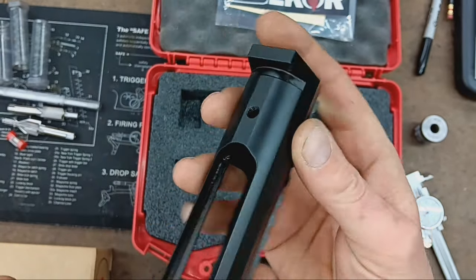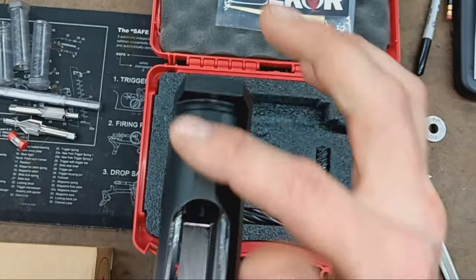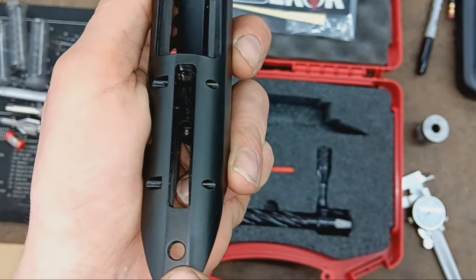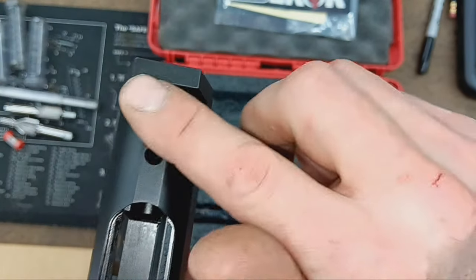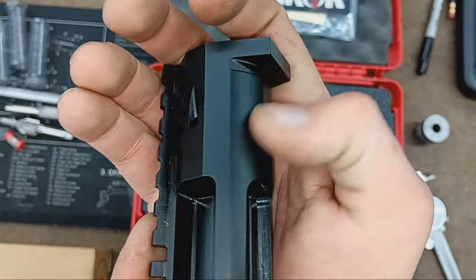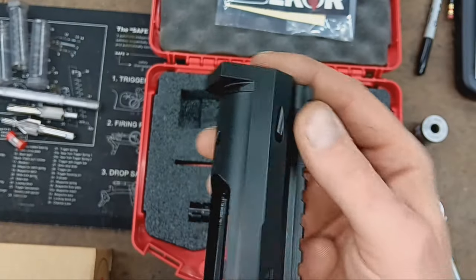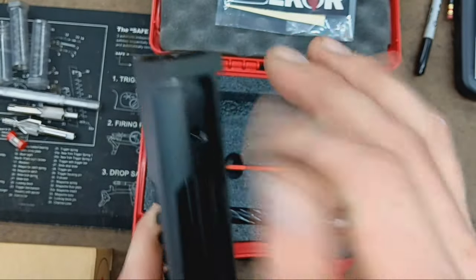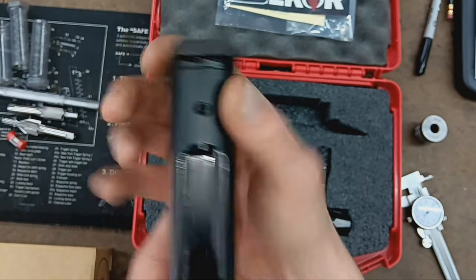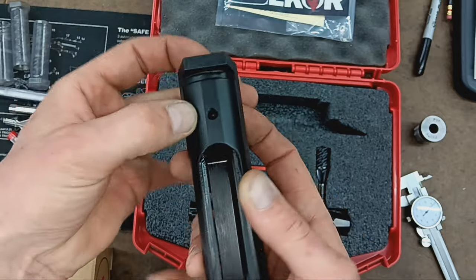Shows they put a lot of thought and effort into this design. Flat, kind of here where the screws go in the center, and then a radius portion here, and then another flat. So this looks like it is eliminating any parallel style surfaces. Like, with a completely round receiver, you would have two surfaces that are parallel with each other. Well, in this case, there's really nothing.